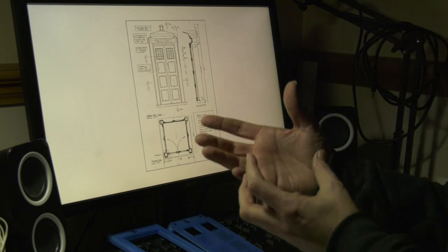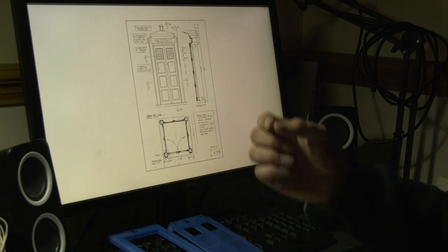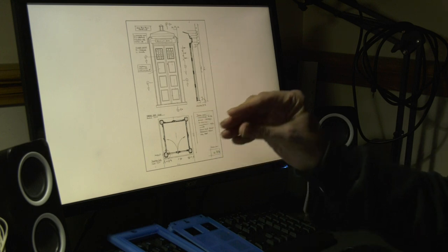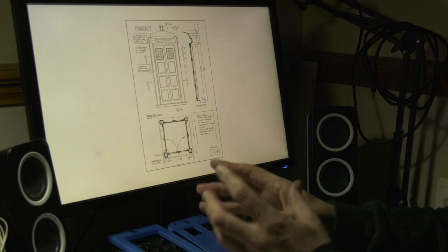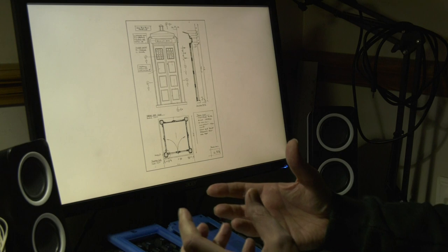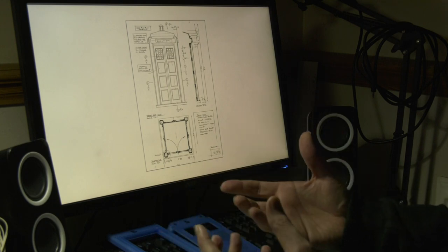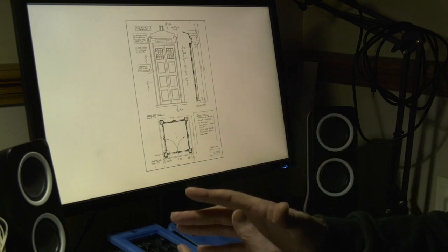However, out in the physical world, the reality is quite different, and that's all down to two factors. The first is the tolerances on your computer model, and secondly, it's the tolerances that the printer you're using is capable of. Tolerances are the permissible limits of variation within the physical dimension. So, for example, a 2 meter wide car would not fit down a 2 meter wide tunnel. So either the car has to be made smaller, or the tunnel has to be made wider.